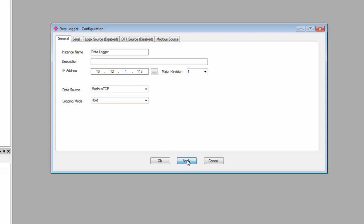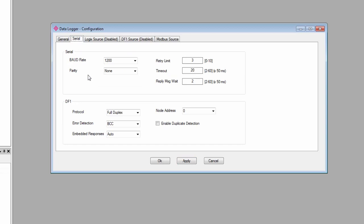Moving on, we'll click on the serial tab where we configure the serial port. Obviously, this only needs to be configured if you'll be logging data for the DF1 and Modbus RTU sources. At the top, we have the basic serial network configuration settings, and below, there's a section specifically for DF1 network settings. We won't be doing any configuring here, but we have another video for the PLX51 router that addresses this